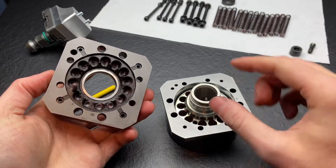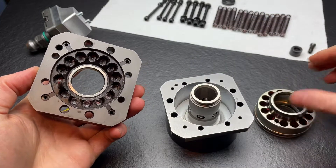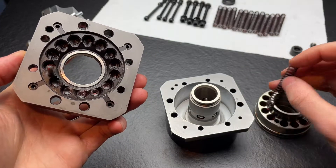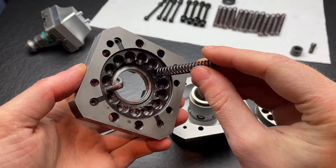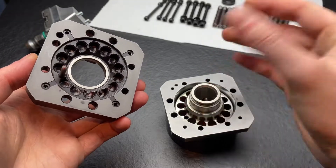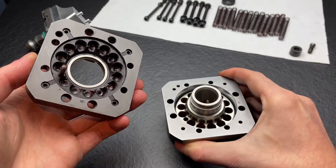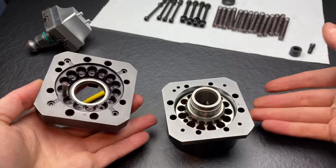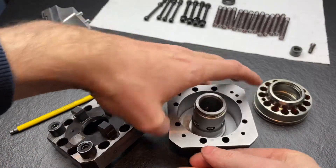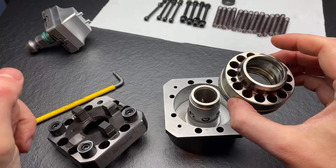If I take this top plate off, you can see the inside. Here is the cylinder which moves, and it has 14 holes for these springs. They are indexed on one side in this cylinder and on the other side in the top plate, and they push this cylinder down. When it is pushed down, the balls inside — you can see them — are pushed inwards. If you actuate it with air through the hole inside, the cylinder is pushed upwards and you can get your pallet out.